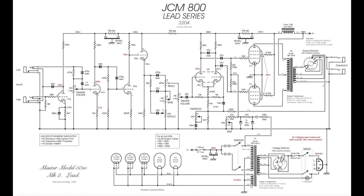The signal comes off the wiper of the treble pot — on a pot there's always three lugs, the wiper is the one in the middle — then into the master volume pot, and out into the phase inverter. The phase inverter's job is to split the signal into two different, opposite but equal phases, which then drive each of the EL34 power tubes. That's a simplified view of how your guitar signal travels from the high input through to the power tubes.